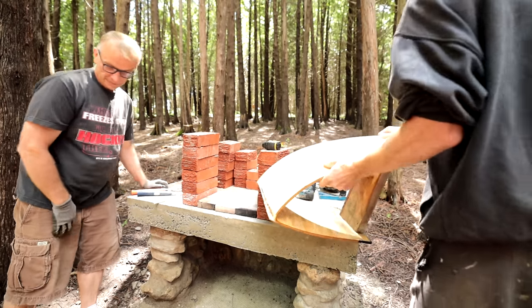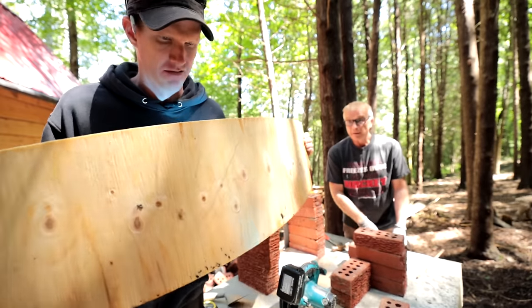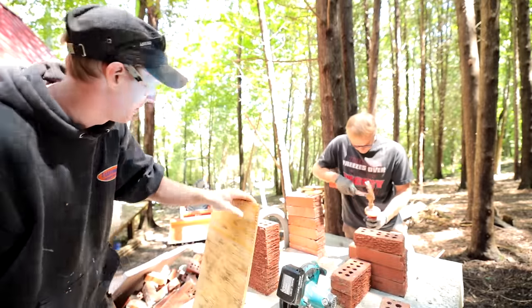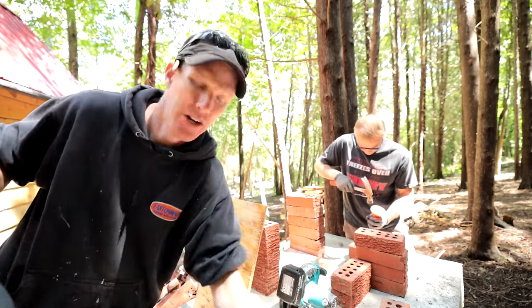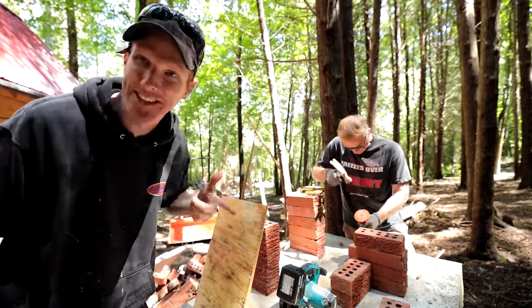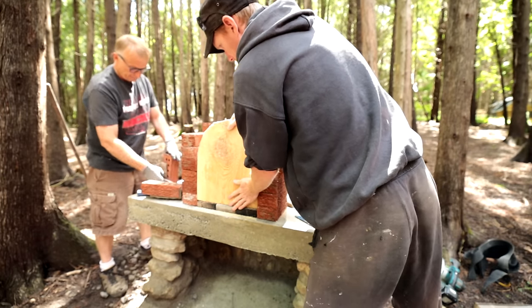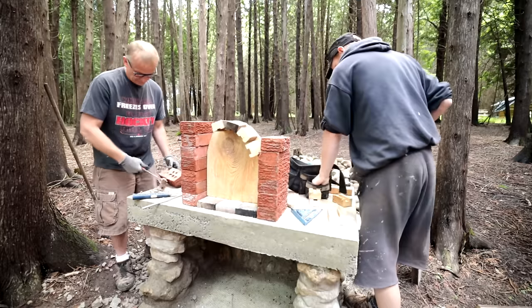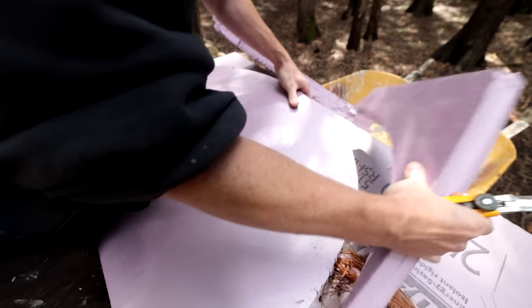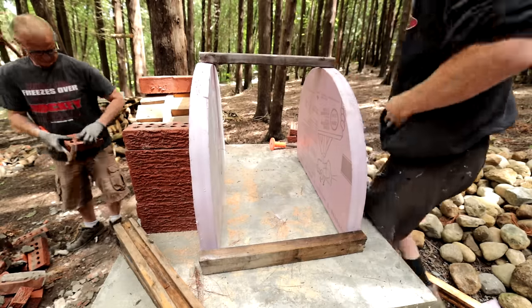That's not going to work. If you're going to fail, fail quickly. I soaked the plywood in the pond and it made it stiffer — even harder to bend, which is kind of weird. After realizing there was no way to bend three-eighths plywood into that tight an arch, I ended up using a piece of pine, cutting it into an arch shape, and tacking on little bits of two-by-three to widen it so the brick has something to support itself against. Don showed up, which is great, because he can clean bricks.